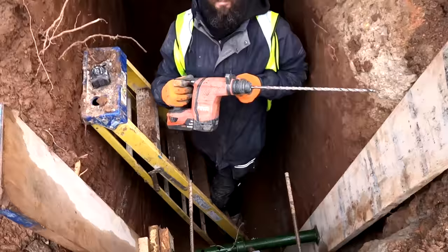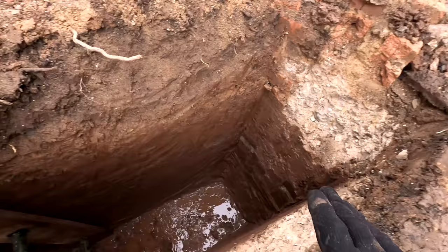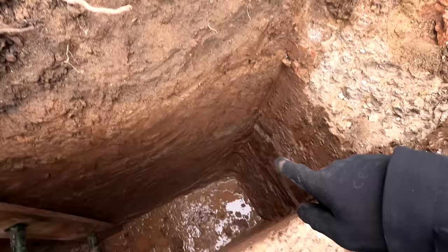That's Will's job for the next little while. And then my job - because I couldn't get the digger any further because of this footing - we're going to tow under the existing footing by 400mm. So this is going to be a hand dig. I'm going to get down in the hole and start digging that out, and then we can get our concrete poured later on today.